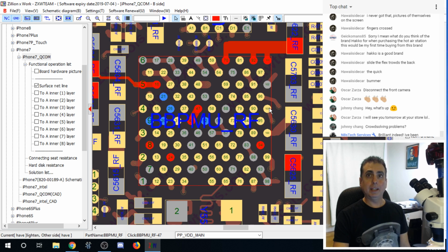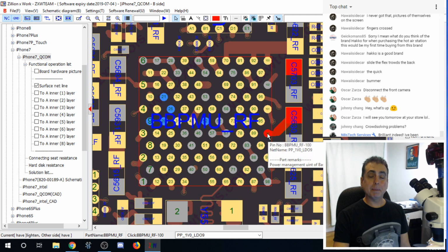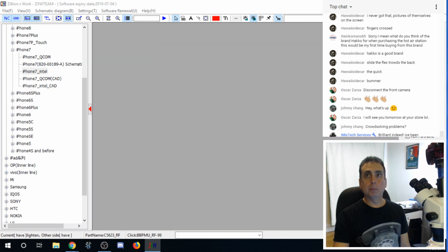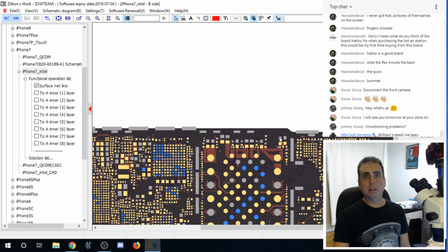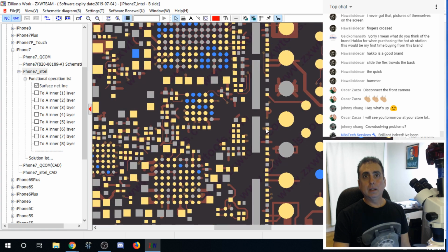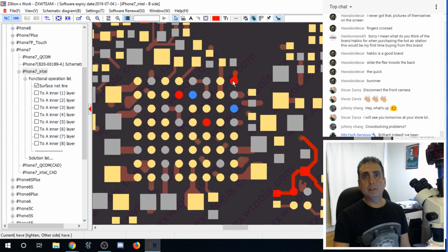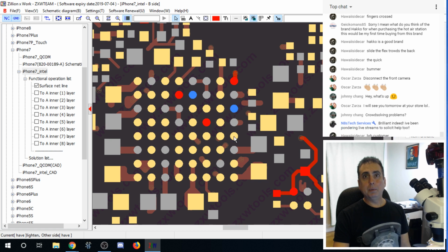Theoretically, from what we know with the iPhone 7, something's lifting up. It's got to be something along the edge here. So if we go back to our Intel board, I think there's only 3 or 4 possibilities here that we might consider jumpering. And I believe, let's see, does this go anywhere? So that one's going to be kind of a pain. We've got ground, NC, ground, and then we really only have 3 other connections.